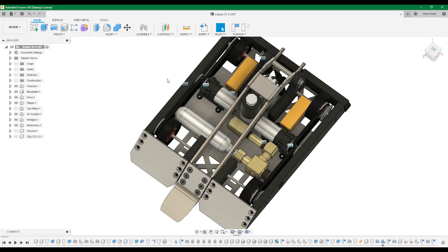There's an empty space to the right of the cursor because I originally planned to have a buffer tank there. The buffer tank would have allowed me to accumulate gas and then quickly dump it into the ram, faster than drawing from the tiny hole in the main tank. Unfortunately I made a measurement error and had to scrap the buffer tank because it would have poked out half an inch from the wall. I'm really hoping the next version will have a buffer tank so I can have the powerful flipping beast I originally wanted.